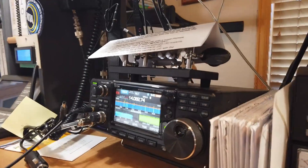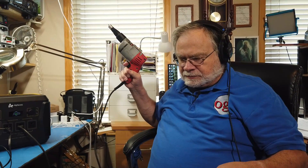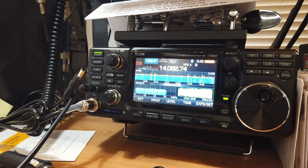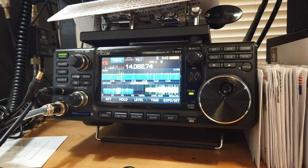Now the big question for ham radio operators is this. I have this tuned to a place on 20 meters where there's no signal. I'm going to listen and try these loads. What we see — and you can see it on the scope over here — is that there is a little bit of an increase in background noise during the period of time that we were using the inductive load. So that's something to be aware of.